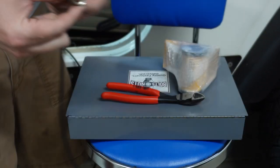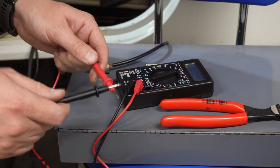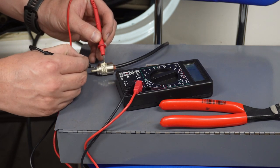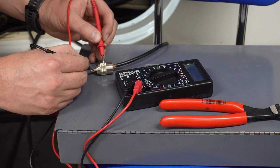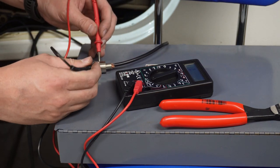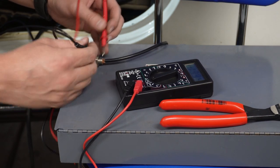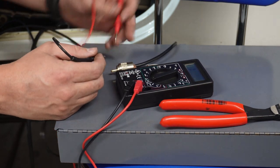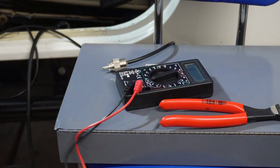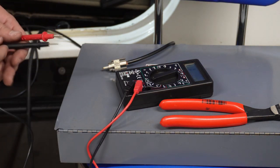Cable is ready to go. I've got my multimeter set up for continuity. There should be none between the body and the center pin — and there is not. But there should be continuity between the body and the barrel — and it does. So that's all correct. I'll check it at the antenna end too, but I don't see it being a problem.